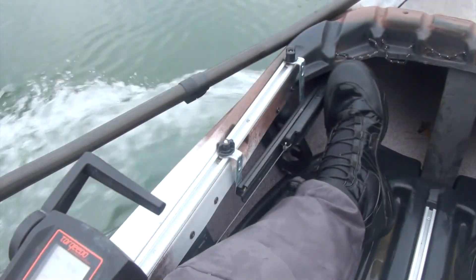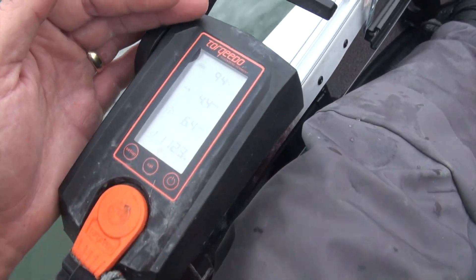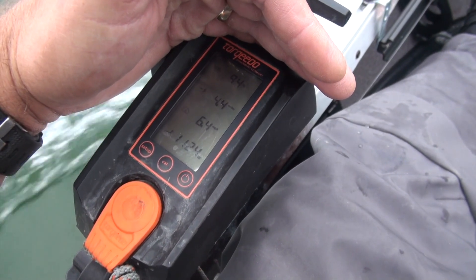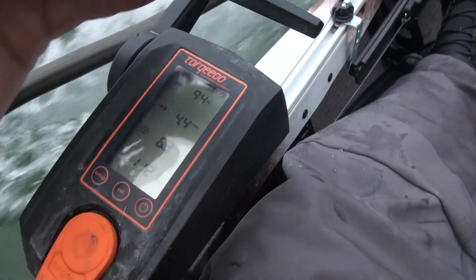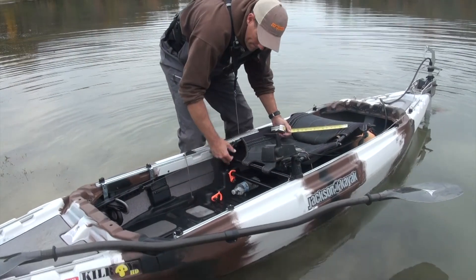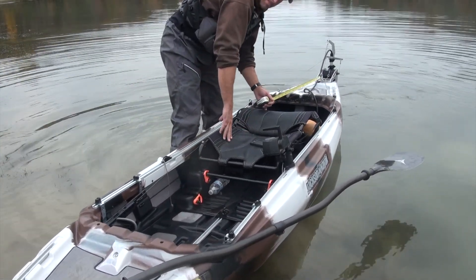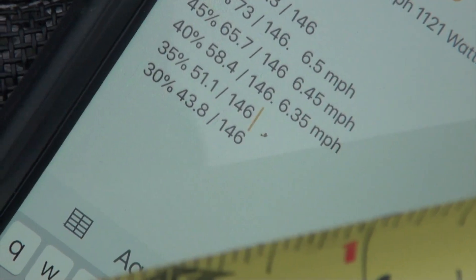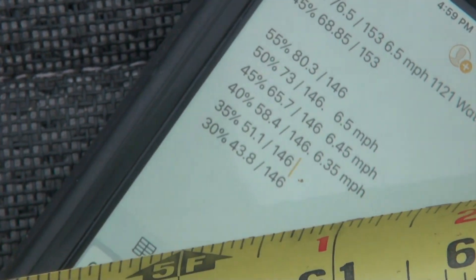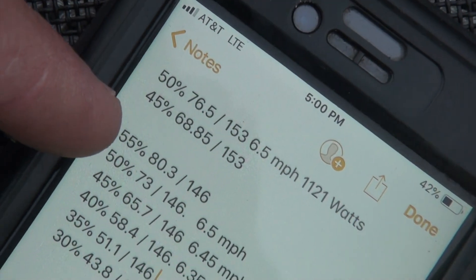It jumps right up, the bow is up quite a bit. We're at 6.4, and we're not going as fast as we have been — 6.3, 6.3, 6.4. I'll call it about 6.35. We've lost quite a bit of speed just going from 45% to 40%. Let's see what 35% does next. Here we are at 55.1 inches. We're going to try 35% and see what happens from there, and then maybe go back up. Seating position is sort of arbitrary — what we're really measuring here is how flat does the boat run at speed.